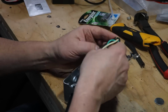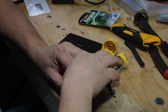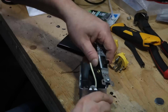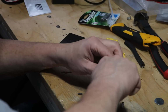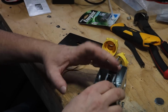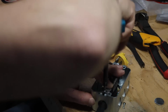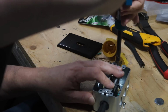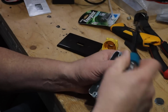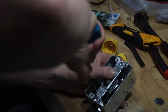And anyway, as this progresses here, I'm just going to chat about the belt sander. There are some features about it that I really like. I got a couple of comments as the progress went along that people thought I should have put a bit of a bevel on the wheels so that the belt tracks better. I wasn't entirely sure, because if you remember from the beginning of the video, I left a bit of roughness on the wheels just so they have a bit more traction.